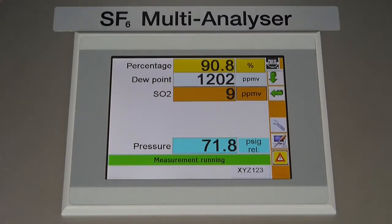If the automatic pumping function is on, the tested gas will then be recovered back into the connected equipment, down to an internal storage pressure of around 3 to 5 PSIG. As a reminder, automatic pumping should not be used when testing cylinders or if multiple tests are expected on one piece of equipment.